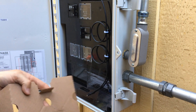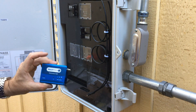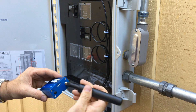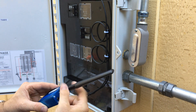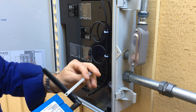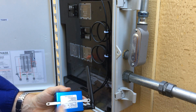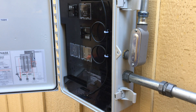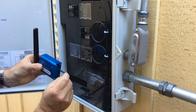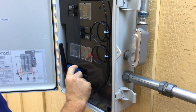The cell modem is inside of here. We want to take the cell modem and screw the antenna to the SMA connector that says 'cell' on it. We then slide the metal mounting bracket into the slot on the back of it. Then I'm going to take the head from the black plastic mounting tab and set the head into the base, which is what clips it into place.